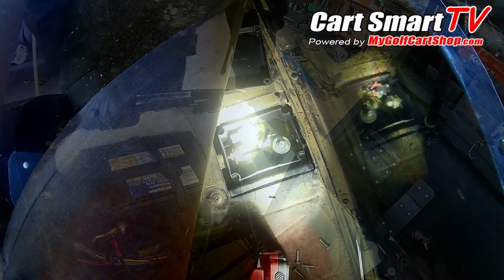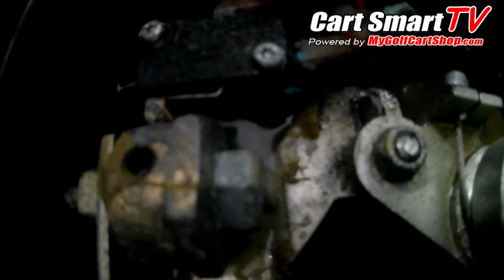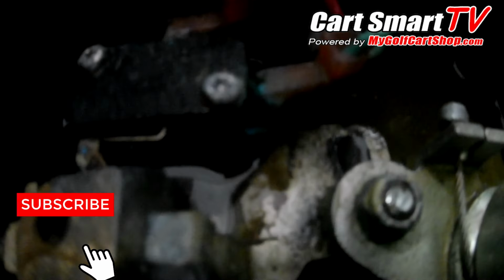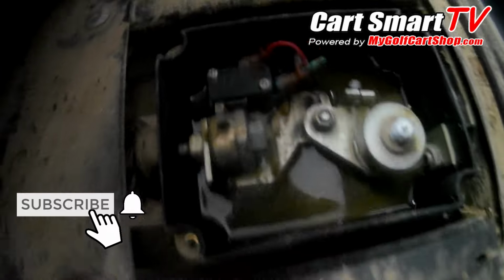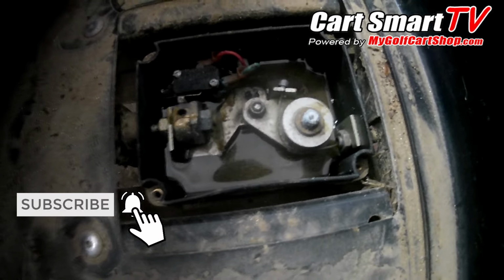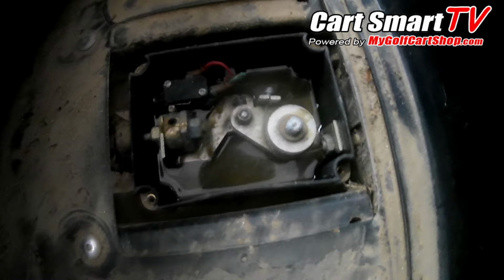So, all right, guys, so I found at least one of our problems, and look at that water there. Well, that micro switch right there is probably gone. It is done. You can see all the green corrosion built up there on the green wire. The red wire doesn't look so bad, but we're gonna get this water out of this box. Looks like the owner didn't realize that this box may have been here, and so no fault of his own,